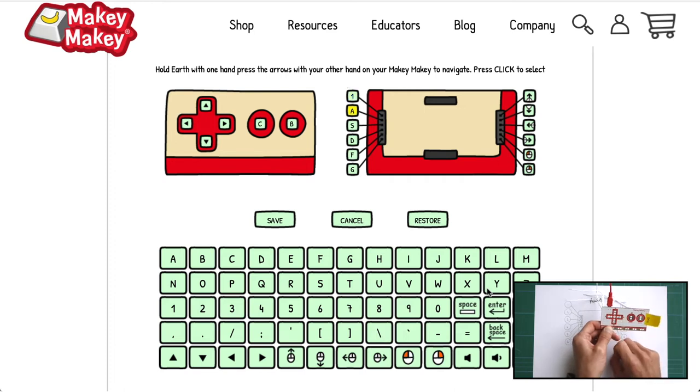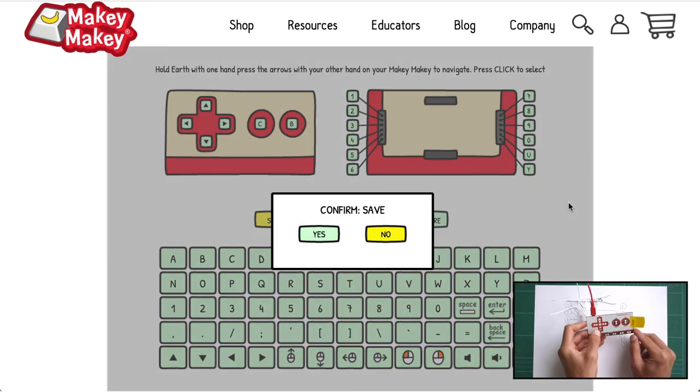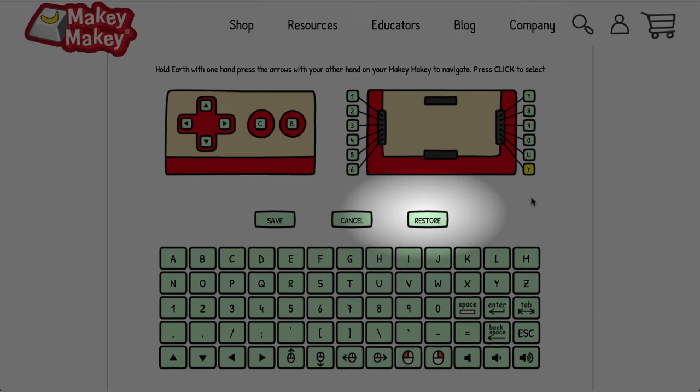Now I'm going to press the right arrow to head to the next spot, press click, find the number 2, press click, and there we go — I've just remapped it. I'd go ahead and do this for all the buttons — I'm going to speed this up. You'll see here on the screen that I've managed to remap all my keys to the ones I desired. The last thing to do on the Makey Makey is hit the down key and then hit save. It's going to ask us to confirm — move over to yes and press click. Success! Then you can close this window. If you want to restore all your key remappings, you'll need to take the steps at the beginning of this video — disconnect your Makey Makey, reconnect all the alligator cables and repeat the process. There is a handy restore button that will reset it back to its original settings.